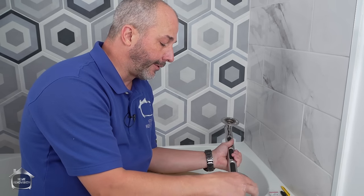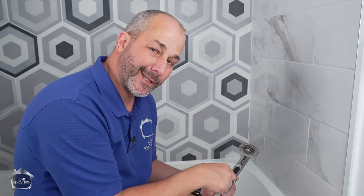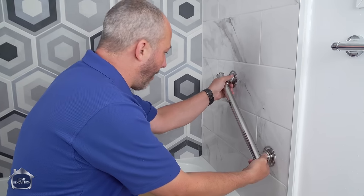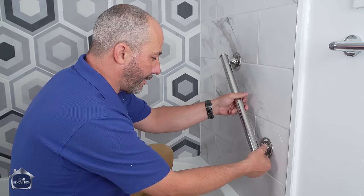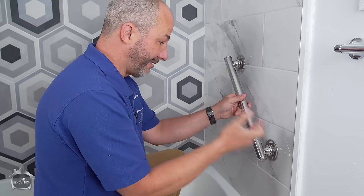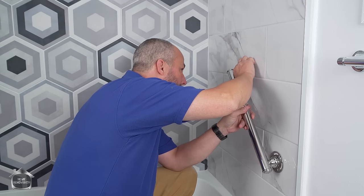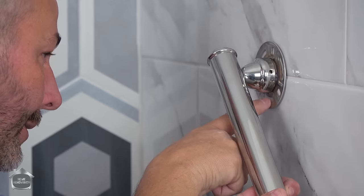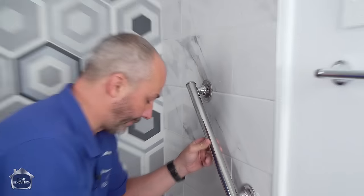Here's the benefit: we have three locations on that plate and three locations on this plate to put a screw. There are washers in the bag and you can install this just about anywhere. We've already determined our stud locations — I know one's here and one's here. I want to talk about making it pretty. If you can make it aesthetically pleasing — this is kind of in the center of the tile, that's on the grout line — that's nice. I want the hole at the top as far away from the edge of that stone as possible to help avoid cracking. You also want to wait a day or two after putting the tile in before you go at it.